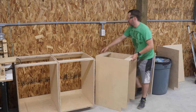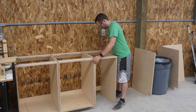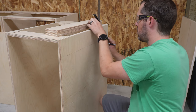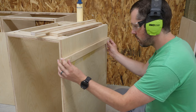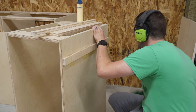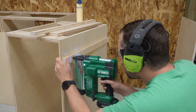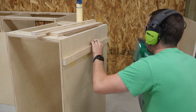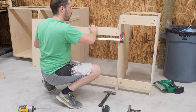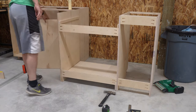Then I moved the cabinet carcasses over to near their final destination, but first I needed to make sure I measured out the shelf for the miter saw itself. To do that, I measured the height of the miter saw's cutting surface, and then measured that gap down from the top of the carcass. I placed some runners that another top will sit on, and since both that top and the tops for the rest of the workstation are the same thickness of three quarters of an inch, I don't have to do any fancy math — I just move it down the width of the miter saw and set a topper on it.